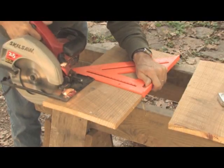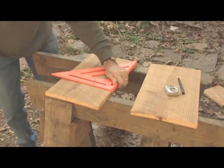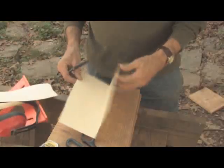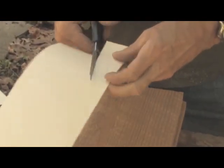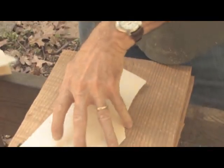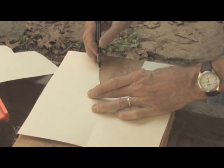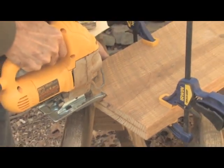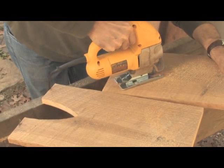Use a circular saw with a speed square for a cutting guide to cut all the parts to length. The speed square, held tightly to the board with one hand, provides a good guide for the saw. If uncertain of your strength, use a C-clamp to hold the square in place. Scribe the cut-out shape in the bench ends using a folded paper template. Card stock or an old manila folder will be easy to trace with a pencil or pen. Simple curves or straight cuts are easiest for beginners and experienced woodworkers alike. Stack the legs for sawing so that both sides will come out identical, and clamp them securely or they may move against each other as you work.